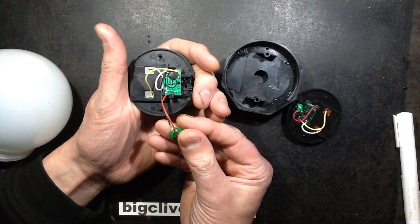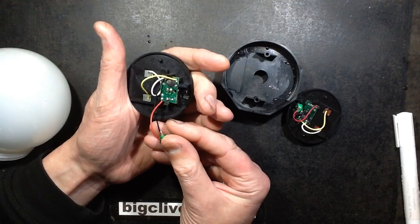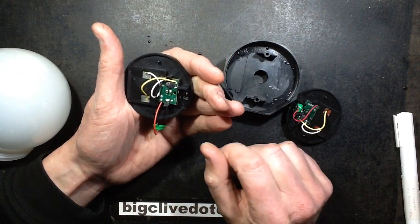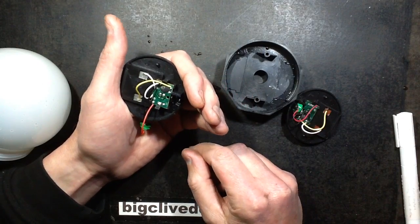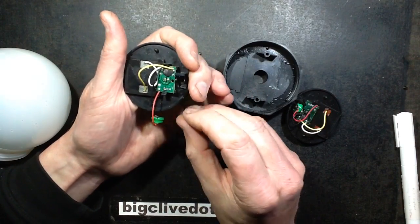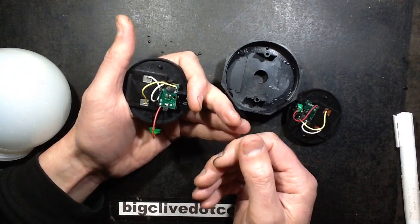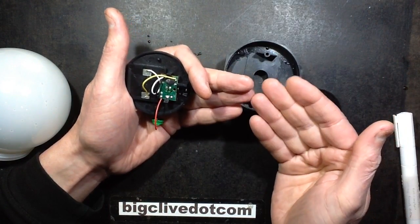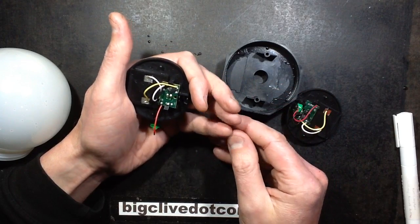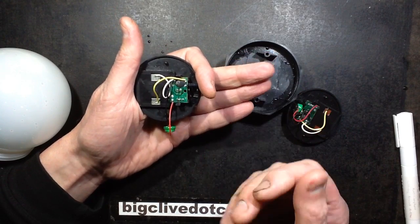It's quite surprising the effect it has. This same electrolytic effect is also used to clean stainless steel - you can get rust and other contaminants off it using a pad and applying a DC current. I think it must be called electrolytic cleaning. A conductive liquid is applied and it transfers the unwanted metals from the stainless steel onto the collection electrode.